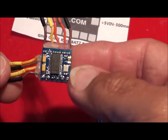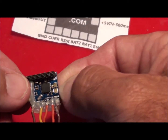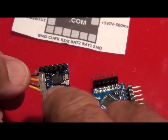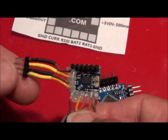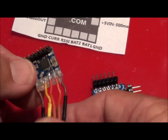What I did with these - I've actually destroyed one of them because they've got those silly little solder pads on there. When I soldered the pins onto it, the pins came off. So I put a bit of flexible wire on there with some heat shrink, colour coded, so you know which ones are ground, which ones are signal, which ones are positive and negative.